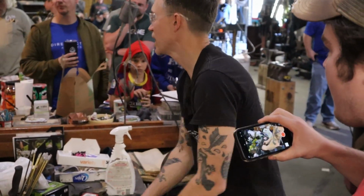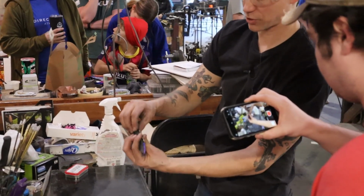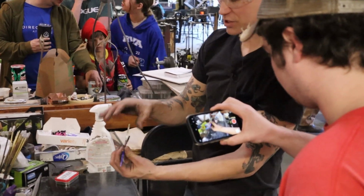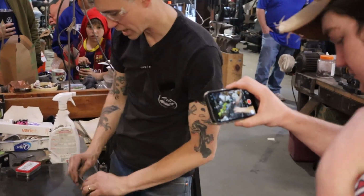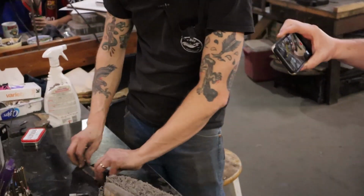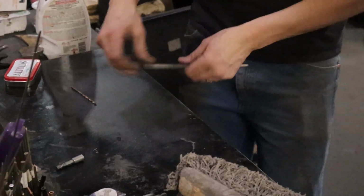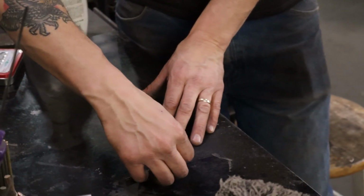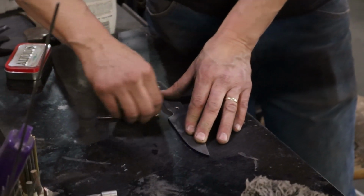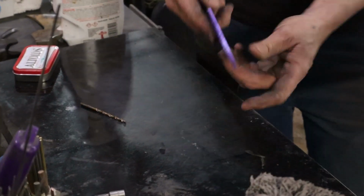Yeah, perfect. So this is going to be about the right thickness. Pretty similar. If it's a little bit off, that's fine. It's going to make 2 scribe marks. You don't have to have granite, but oftentimes you can get a little piece of granite for real cheap or free off of a kitchen demo or something. So we're just going to scribe with the drill bit center. You can hear that. Scribe it on the other side, and we should get a line.